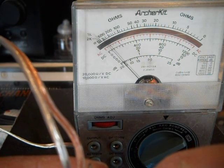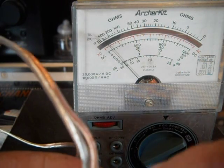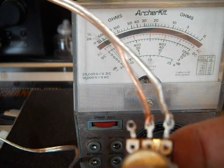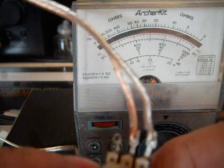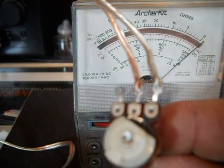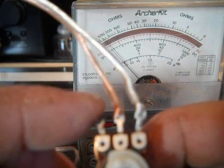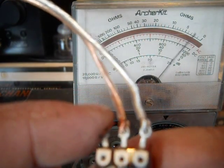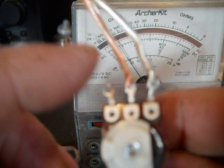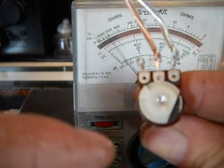I've never had trouble on a CB putting a knob in there like this. I know there are correct ways to do it by adding stuff to it. In a radio, sometimes all three legs will be on the circuit board, sometimes it'll just use two. Sometimes the other leg will make it go back to ground more — as you're turning it down and it gets over here, this will pull more to ground, which will kill it down more. If you're going over here it'll help pull it even more, because you're grounding it down more as you get on the end of this horseshoe path.